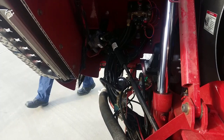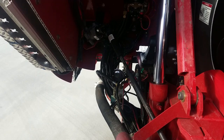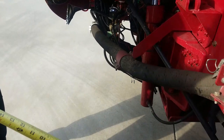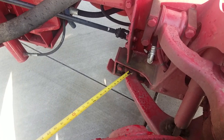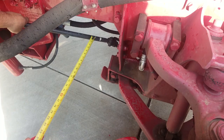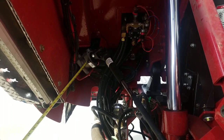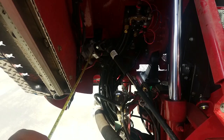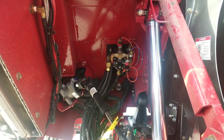Once a person gets in the routine for a pre-trip, a good pre-trip will take you maybe 20 minutes. During instruction it can take an hour to an hour and a half because you're talking about everything. We go from the wheel end — this truck has gearboxes underneath the frame. Take a visual for loose things, loose bolts, leaking hoses, cracking frame, anything like that. This is the shaft from your steering column to tell the steering boxes which way you want to go. Get your hand on it, make sure it's not loose, make sure there's not a bunch of play, bolts aren't missing. This is the miter box — the 90-degree change of direction. It takes the steering column and makes a hard 90. Basically make sure when you grab it, stuff isn't falling off. That play you can just feel from the steering wheel.